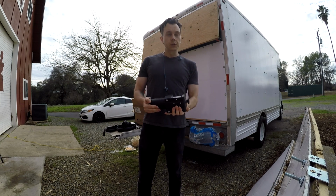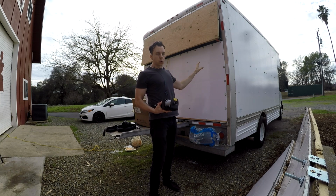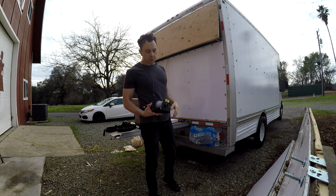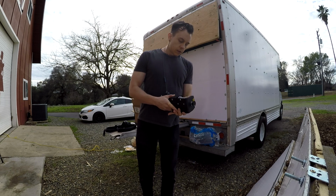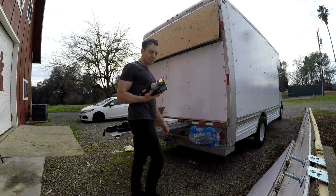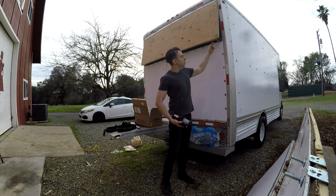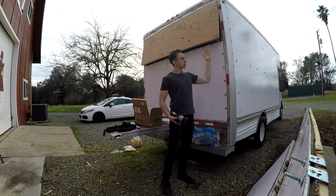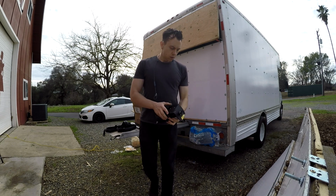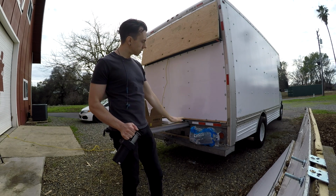We're going to have to put some infrastructure in the inside first. We'll have to do the framing of the door and the windows. It'll be the actual living space right behind this door, and then see how much space we've got to work with. So this is going to end up being mounted underneath here, and then the cable will come up to a pulley. It'll be mounted here, and then a cable will be attached to the door, so when it opens on one side it can pull the door open and closed. And then there will also be chains attached to the door to hold it at a static level.